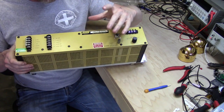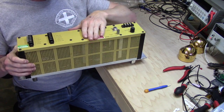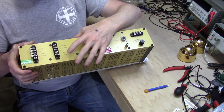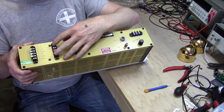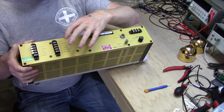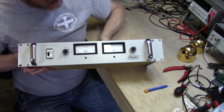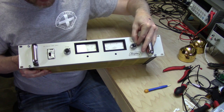Here's the standard disclaimer: this is a high voltage device, so you want to be very careful. If you don't know a lot about high voltage, steer clear of this — watch the video and enjoy it. This particular unit has programmable current and voltage; you can control that here. There are a set of jumpers — I believe this is installed for local control, but I'll verify that with the installation data sheet. You can also control this remotely via these terminals. It has really nice vernier controls that are locking, so you can lock the settings.